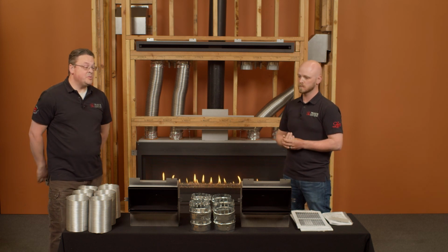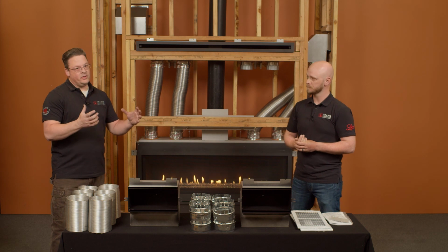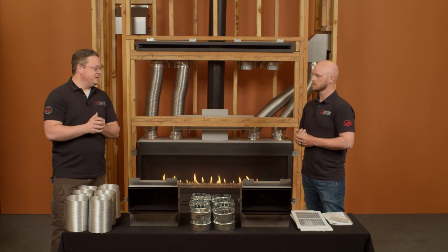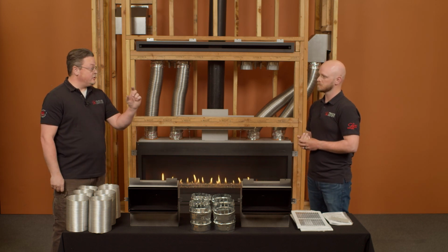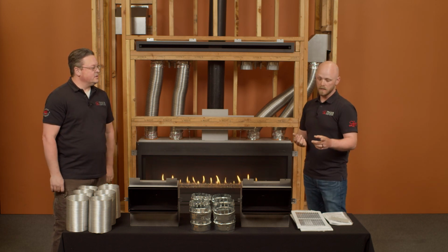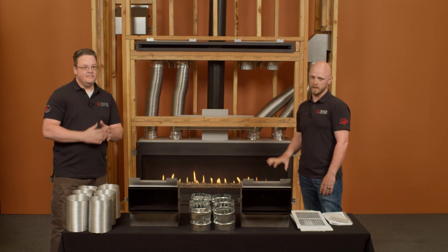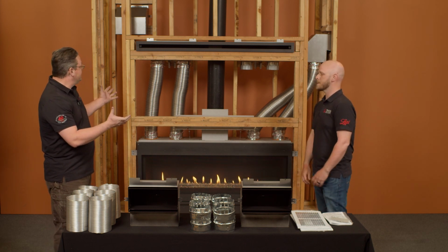I suspect most of the decorative grills actually probably have more space. Absolutely. Because they'll have some filigree or something more decorative, and they're actually more open than that grill. So in theory, they should be good. But that call out should be on the register. It is, as well as the call out is in the instruction manual for the CoolSmart kit. Okay, so we've got a nice setup here.